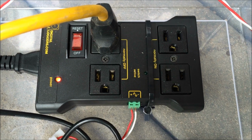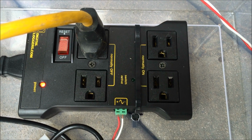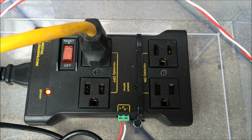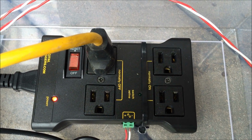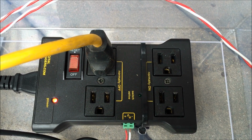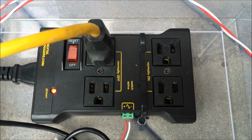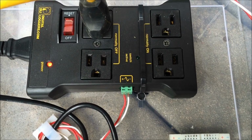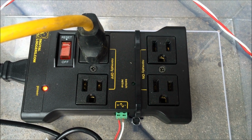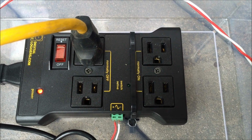This is the IoT power relay. I've got one cable plugged into it, into the ports that are labeled normally off. And this cable is connected to the pool, and specifically the saltwater system and the pump/filter. And so I control this over low voltage wire. Send some voltage to this, and it basically turns the normally off ports to on, and then reverse that to turn them off.